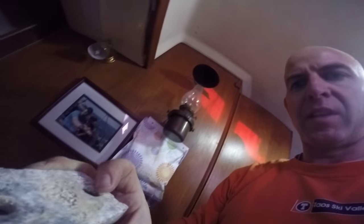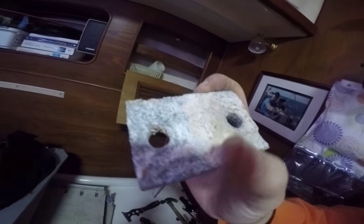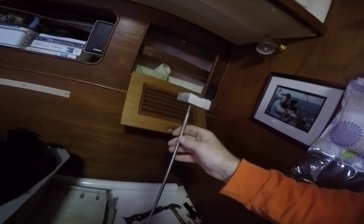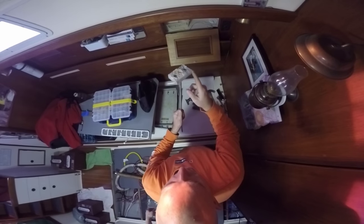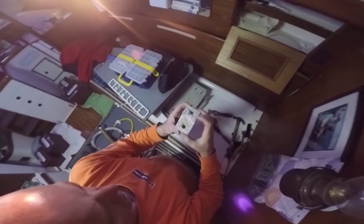As you can see, this is the backing plate here. There are tons and tons of corrosion. You can see the rod heads are really corroded in there — it's not even moving. And you can see it looks like there's some bend in the rod, and I don't think it's meant to do that. It's not in good shape. That's a reason to redo your rig, a reason to pull everything. This was hidden — we couldn't even see it. That's the problem: you don't see it unless you pull it.